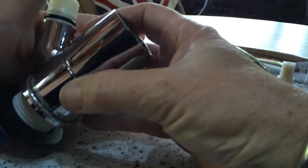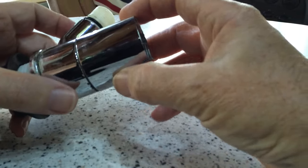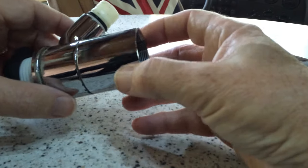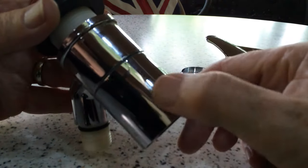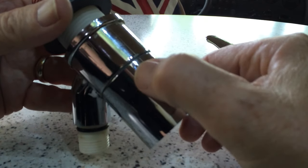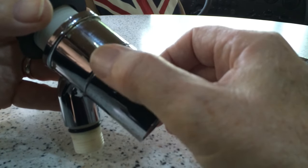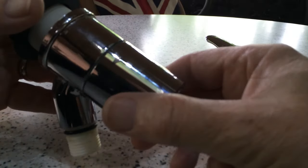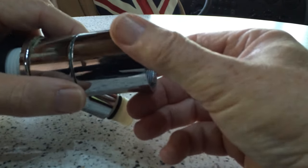One other thing that can make your tap leak above the top surface is this body part here. It's the same sort of brittle material as the spout, so if the tap has been leaned against heavily, you can develop a hairline crack. That's actually what happened on this tap — you can see where the chrome has come off — and that hairline crack was stopping the body from forming a tight enough seal to keep the cartridge sealed. So this one actually needed a new tap.